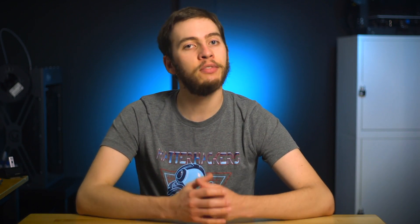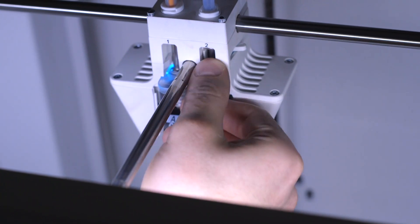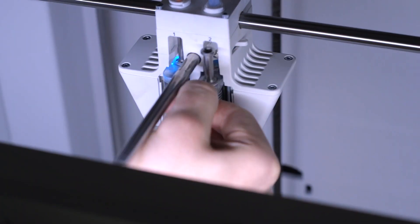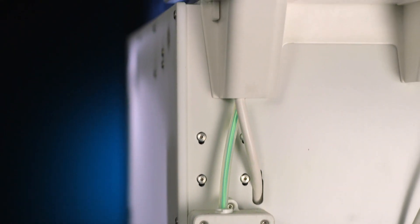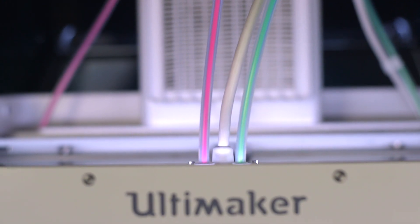In simplest terms, to get multicolored prints on an Ultimaker, you will need to be using an Ultimaker S3 or Ultimaker S5 as these have two nozzles. Rather than using a BB print core in the second slot, use the second AA print core and load it with the second color you would like to use. It's important to note that you need material compatibility in order for the two materials to stick together, so you may need to experiment if you're trying to print with, for example, white ABS in print core slot 1 and red PLA in print core slot 2. Best practices would be using the same material in each print core, just different colors.